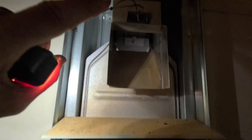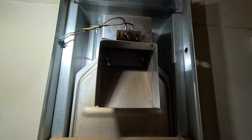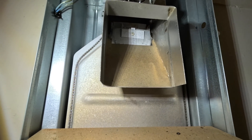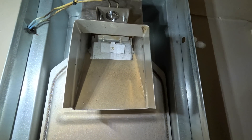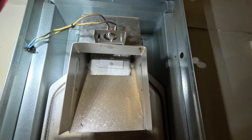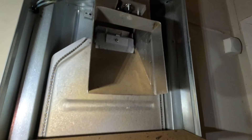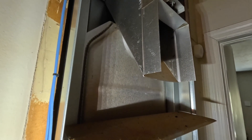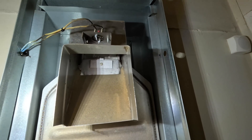All right, I think that's all right — we are on and running. The reason we call this a spill switch is because if the flue pipe gets stopped up, this right here becomes the flue pipe. It gets really hot and causes that to trip. That's why you have a manual reset on it. You cannot bypass those — they have to be replaced.